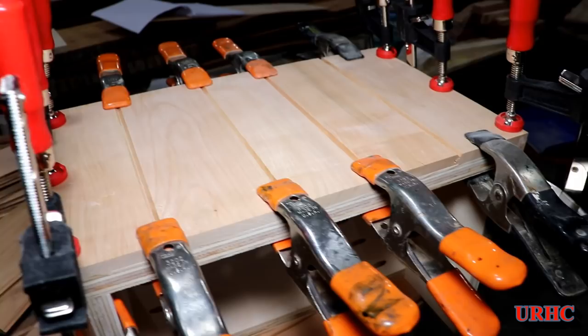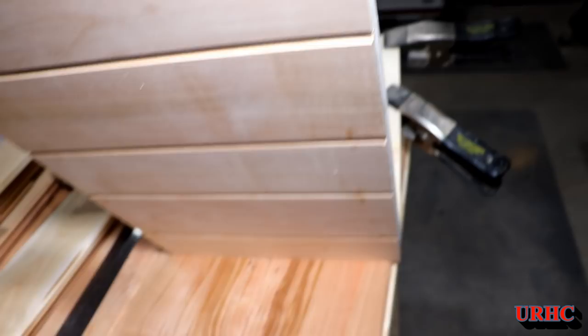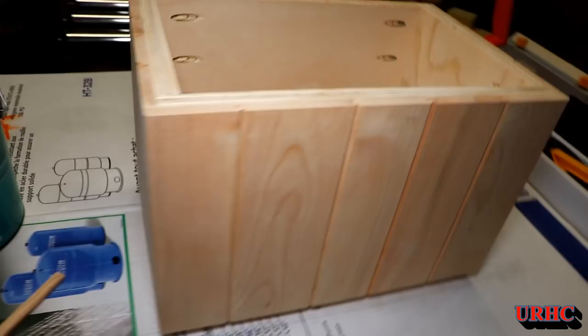You can see I've got them starting to glue on — I'm gluing just one side of them and leaving the other side floating in the tongue-and-groove so the wood can expand and contract. I ran some glue down one side with some clamps, and I'll show how I put them on when I do the side.